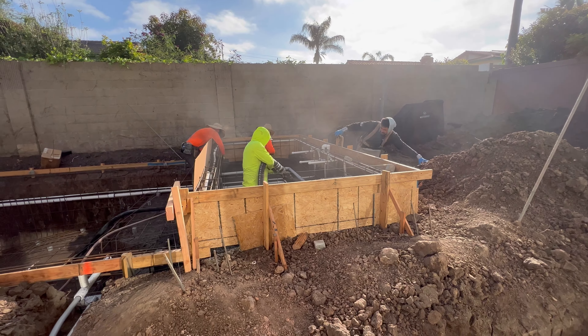This is the shotcrete process. Shotcrete is shot wet, whereas gunite — which used to be really common and still is in some areas — has a dry line and a water line that mix at the nozzle. Coming out of the truck it's wet, although it's super dry as opposed to normal concrete, which makes it a lot stronger.